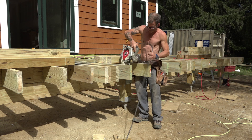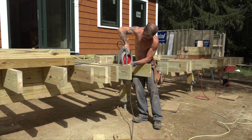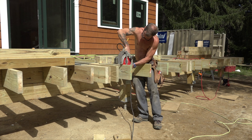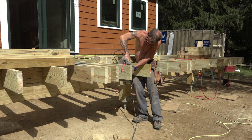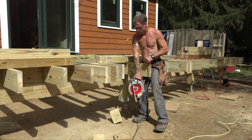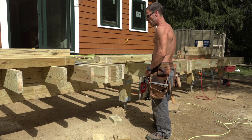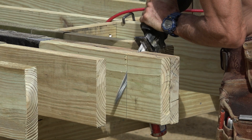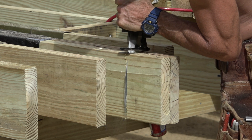With the blocks in place, Rick cuts the joists to length. One advantage of this is that you can cut the length to perfectly match the decking width — you just have to do a little math. Snapping a line and marking the joists after they're installed is a good way to make sure the outer rim is perfectly straight, or at least as straight as the carpenters can cut — which looks to be perfectly straight in this case.